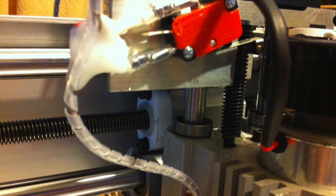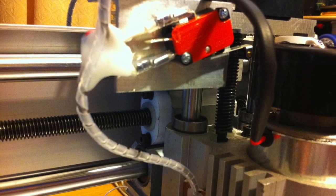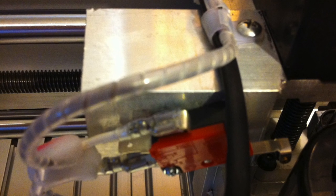Hi there, this is FixedIt. After connecting up the Z axis switches, I put some plastic sleeving around them, winding that up until it reached the top so it's all rigidly held in place.